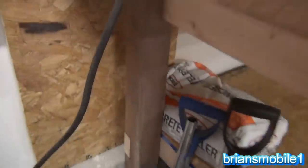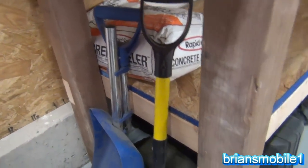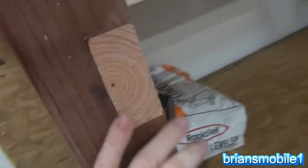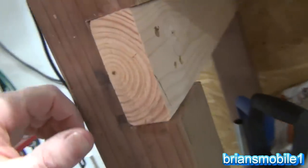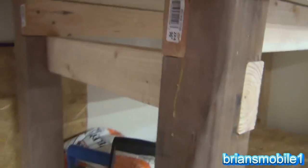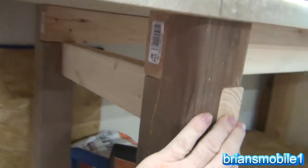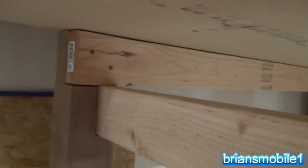Getting up close, you can see that I've cut notches in the 4x4s. The way I did that is I just took a speed square and ran the saw along that, set the depth as the depth of a 2x4, so they're just nice and flush. I filled these full of glue, and then I used outdoor heavy-duty Torx screws that were 2.5 inches long. You can see I've got one going this way, one going this way, and another one going this way — so I've got them sticking out here and here on this one, and then a similar thing on the other.